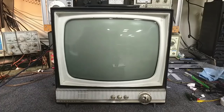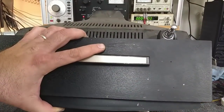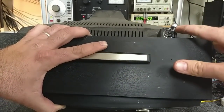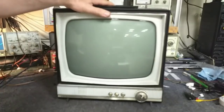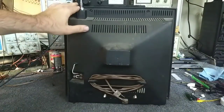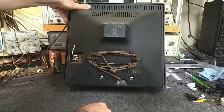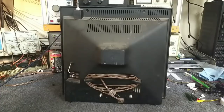For a cheap plastic portable that didn't weigh 60 pounds, they were pretty decent. About the only flaw this one has, other than the peeling metal, is on the top here — you can see that the little base that holds the antenna broke. I think I can get that back together and epoxy the hole over so that it's usable. Coming to the back, it's pretty simple — very basic user controls: your vertical hold, horizontal hold, and vertical size and linearity. This one still had the built-in antenna connected.